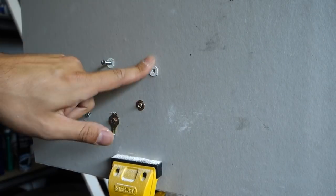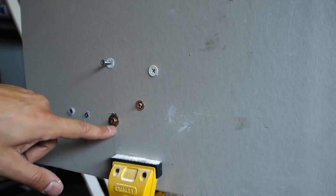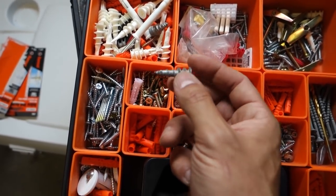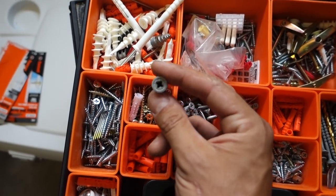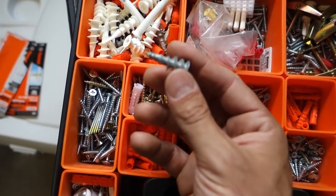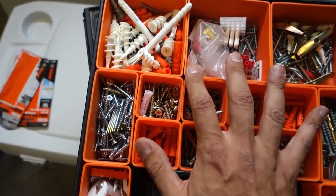It sits perfectly flush. And the upside is most people have white walls, so you'll find that even if you removed a screw or a picture frame and didn't want to patch the hole, you can simply leave that plug in there — they're not very noticeable. Now these plastic wall anchors also come in steel. The benefits of the steel ones are that they're used for any hard surfaces you have to get through — such as compressed fiber cement sheets on the exterior of your house, in your kitchen, or in your bathroom. These are able to get through without breaking or ruining the head of your wall plug, and you can even get through soft timber with these. They're used in the exact same way as the plastic ones.